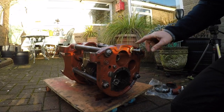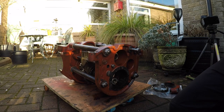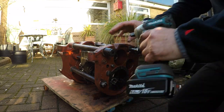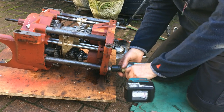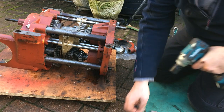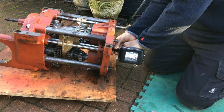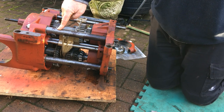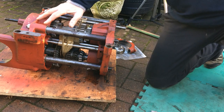As you can see here what's happened is that back bearing has dropped out, and it's not supposed to do that because this washer is supposed to maintain the outer race in the casting. Pull the spacer bars off, rattle the four nuts off, and we'll put witness marks on here so these spacer rails go back into the same position they came out of.